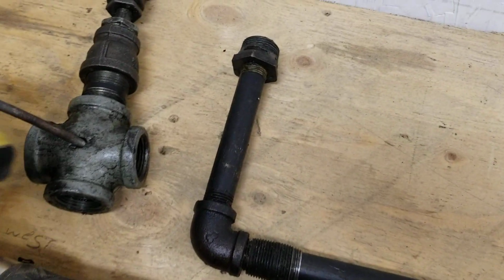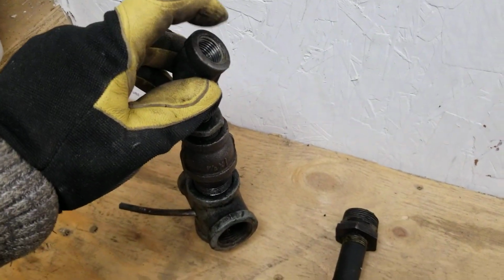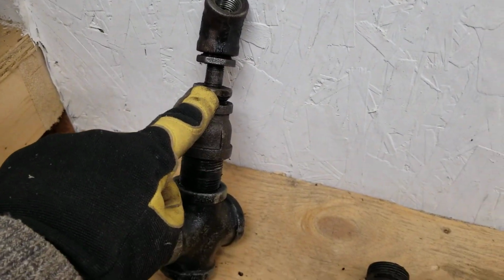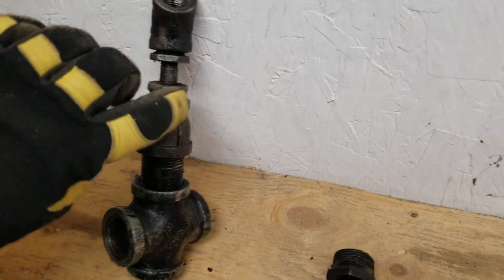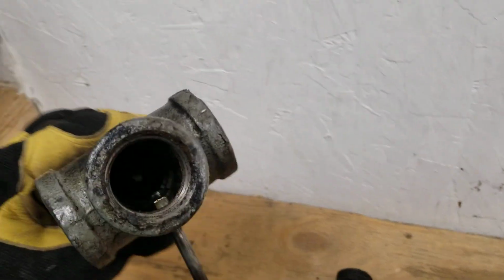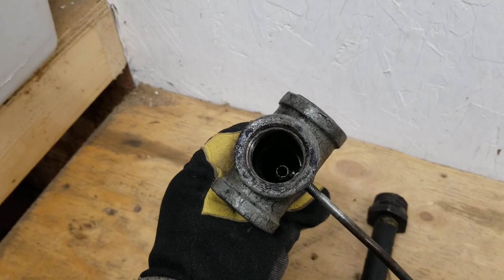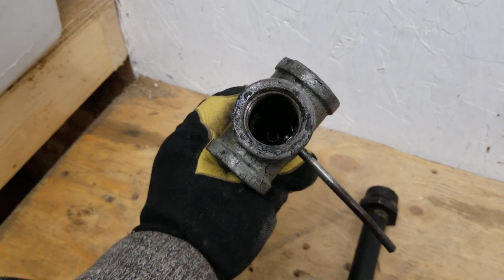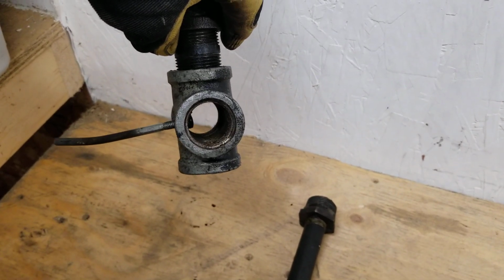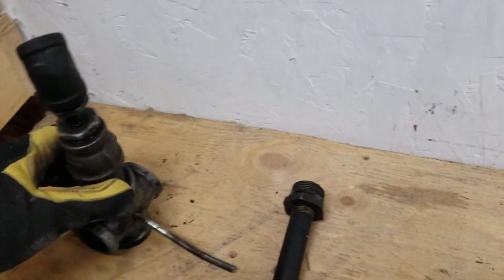This is the oil inlet. The top pipe here is where the hose connected from my bucket, and that's a 1/2 inch line, and it comes down right here to 1/4 inch. I fed that into the two reducers so that it would center, so that the stream would drip. You can kind of see it in there if I get the light right. That would allow the oil to drip right down the center through this cross piece. And that was your viewing window, so you can see how thick the oil was coming through.